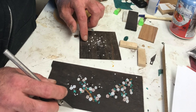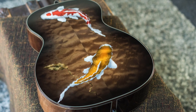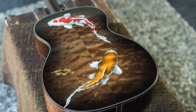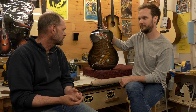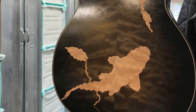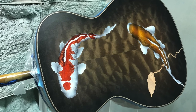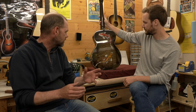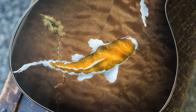This guitar has been at least a year in the making, with quite a lot of design work beyond that. We have artwork on the back — some koi fish that are actually stained into the maple. Over the past few years I've been using wood as my canvas, using stains and tints to put images into the wood while still having the life of the wood there. I don't like to cover up too much of the wood, so a lot of this is stained in — it's not affected the wood in any way, no thicker build, no inlay, so it maintains its structural integrity and sound. I wanted everything else to be subdued and dark to really make those fish and the brass pop, giving that murky, mysterious look of water.